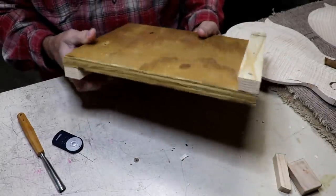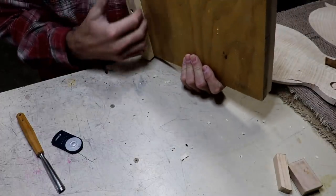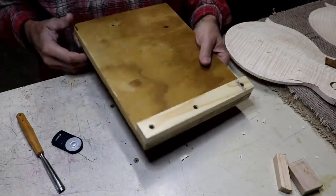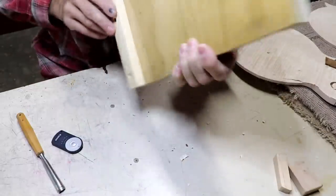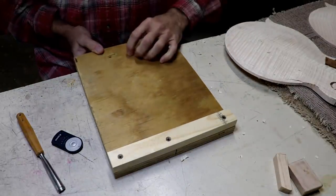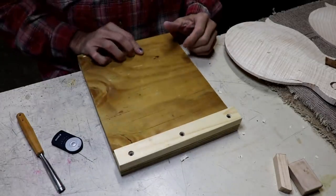It's really simple. In this case, a piece of three-quarter plywood. You put a three-quarter cleat on one end and on the other end. I also put a slight bevel back under this and that helps it grip the edge of the table really good. And the same way on this. So it doesn't matter which way you turn it - it'll grip the table.